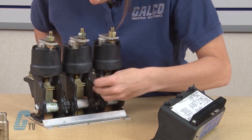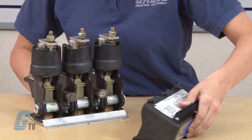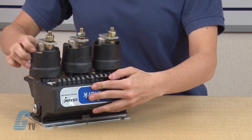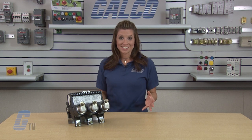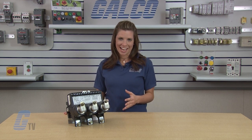A 3-phase contactor contains 10 basic parts. The contactor can be assembled without the use of any tools. The control module contains the coil and auxiliary contacts wired to a terminal block, and are easily removed for checking or immediate replacement. The phase assembly and the control module are the only two replacement parts. The phase assembly is a vacuum interrupter containing the power switching contacts.